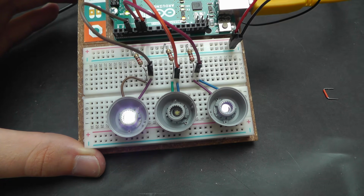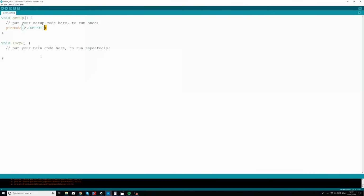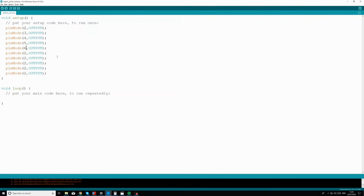It is a little bit unusual for a model video, but some coding in the end. The function pinMode means that you can set each microcontroller pin to output or input. In my case, I need only send a signal out of the controller. I create a new function which turns on one parallel circuit every 1 second.